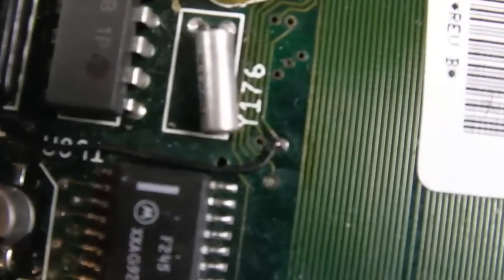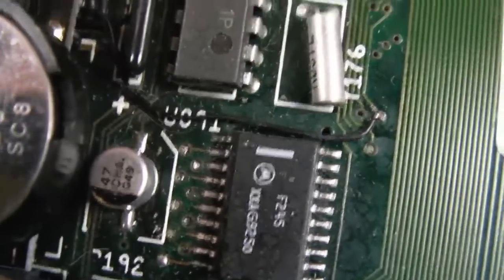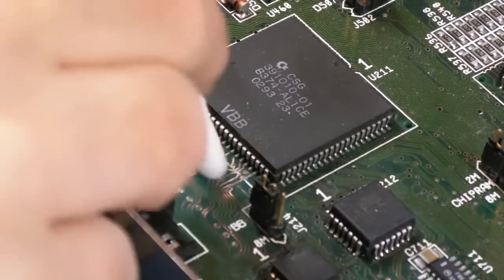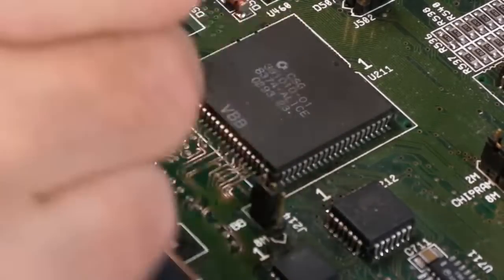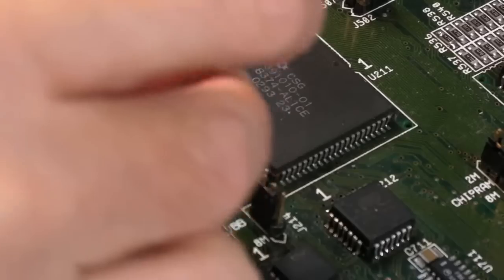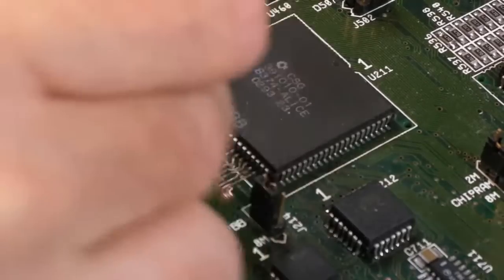And here, look at the vias here, a bit dark. So I'm going to tin some of these up and scrub this area again. So you can see I've had a really good scrub around here with the fiberglass pen, and I'm using some vinegar now. Cleaned a number of times with IPA. Look how gold and shiny those go. It just helps, something you should do before you start to solder on these, because you just etch the surface just a tiny bit. It's nowhere near acidic enough when it's wiped straight off like that to cause any damage.